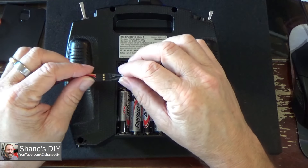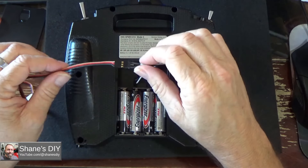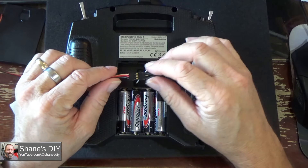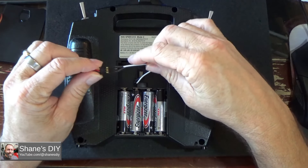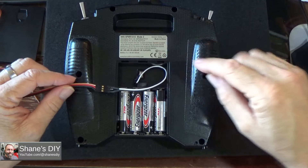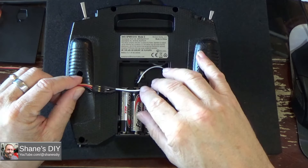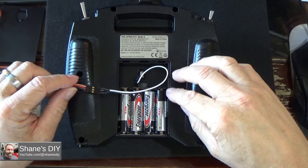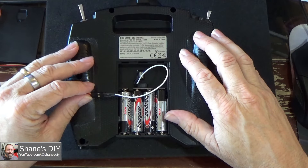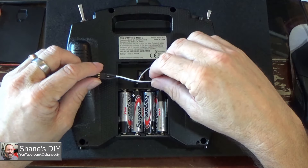It's really easy to make your own cable — no reason to wait for a backorder to clear. Just get some jumper wires and hook that up. You do need the USB programmer; you're not going to get around that. Just pick one up — if you're going to be in the Spektrum world for long, you're going to need it. Keep an eye out for more videos; I'll probably do a couple more on this radio to show how the channels reconfigure in different modes, and perhaps some modifications or hacks. Thanks again to Tim at MidwestRC for hooking me up with this radio. Hopefully it'll help you out — thanks for watching.